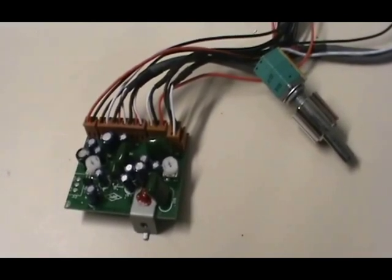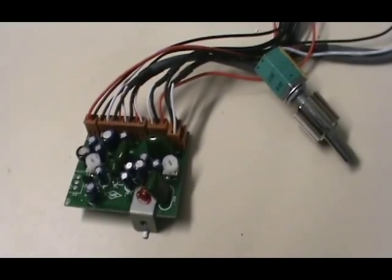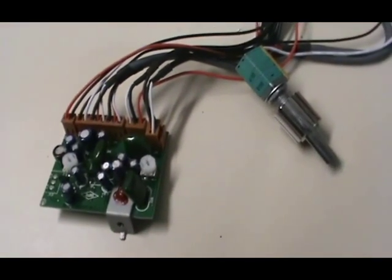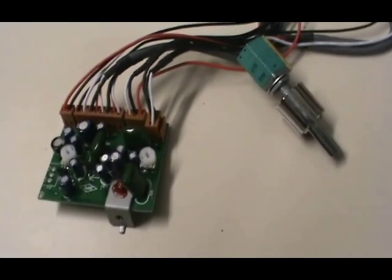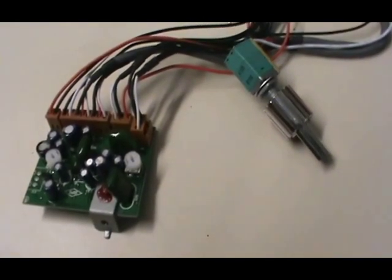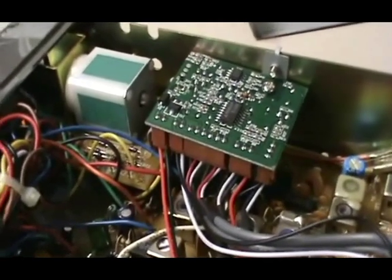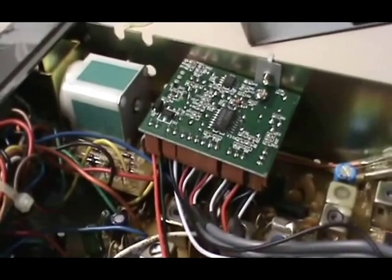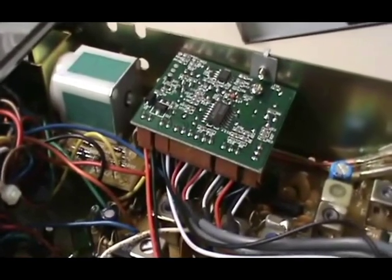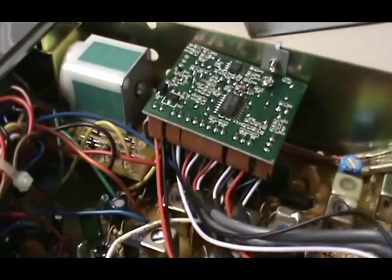That completes the wiring section — fairly easy, just wiring a couple of wires to the microphone plug and one wire to the audio wire removed from pin two. The next step is mounting the echo board and the control knob. We're going to remove the RF gain knob from the radio and insert our echo control through the face of the radio. The only negative to mounting it this way is that the two adjustable pots won't be accessible, so make sure you make those adjustments before finishing the install. It's cushioned by the wires and nowhere near touching any components — a very safe mounting location.